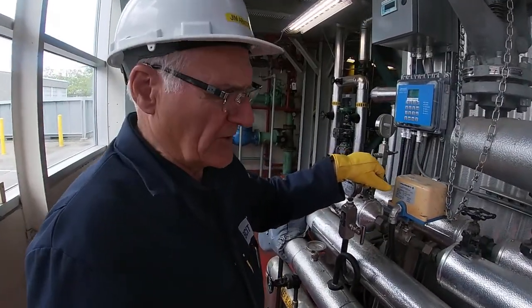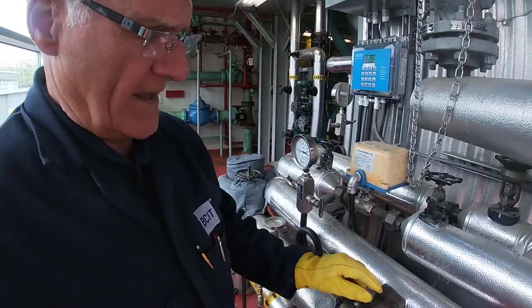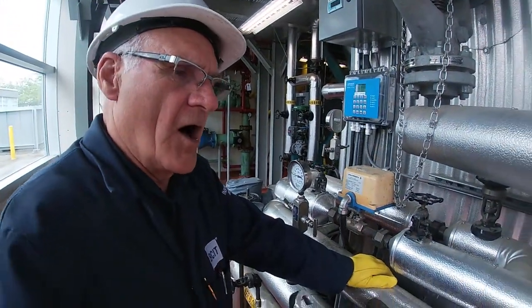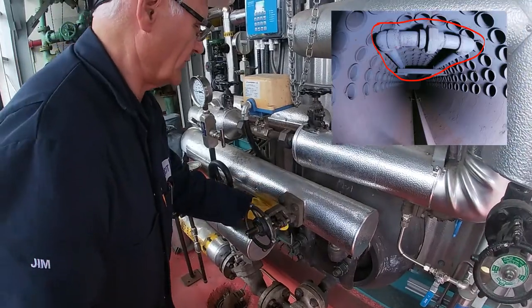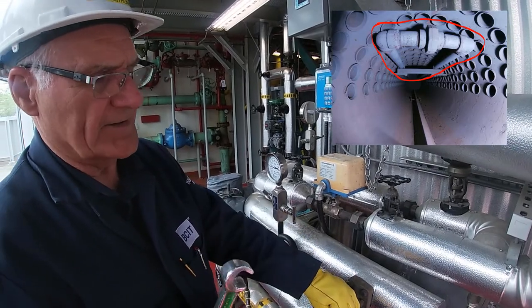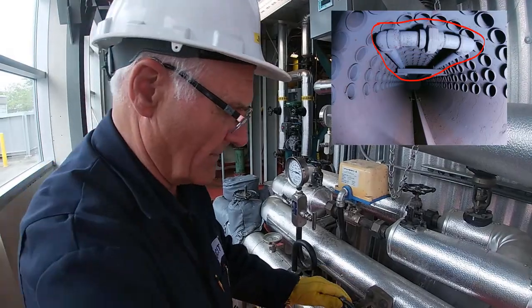Okay, we've got a flame in the boiler right now, starting to warm up. It's up at about 50 PSI. And what I need to do now is to close off the steam coming from the electric boilers upstairs. We have hot standby coils that are actually here, and the return coil is over here. It's just a pipe that goes into the drum and comes back around, and steam from our electric boilers is going through there, keeping this boiler actually warm.